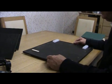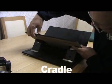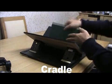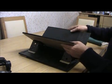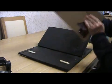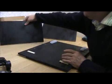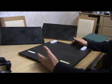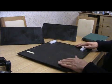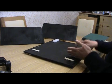This is the cradle which holds the book and it has three major components: one side of the book holder, another side, and the book goes in the middle. This is made out of MDF — you could use plywood or some other material. It rests upon the baseboard. This whole part of the mechanism moves completely freely; it's not attached to the tubes at all. It has to be able to move sideways to allow for the thickness of the book. Underneath there are a couple of drawer runners which just slide backwards and forwards, with a little bit of Lego at the end to stop it going too far.